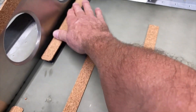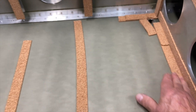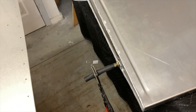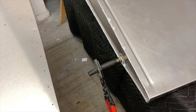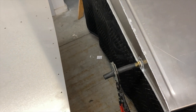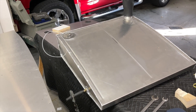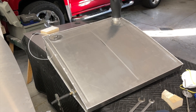When the bottom — because it sits quite high off due to this angle — it sits quite high off by the time it comes over here, and this will be for when the tank settles down. Real quick — I just put a nipple on there with a piece of hose and blow air in, have a clamp on there ready to go but very loose. As I blow up the glove I just snap that shut, then test the ends with soap to make sure it isn't leaking. That works really good — no valves, nothing fancy.